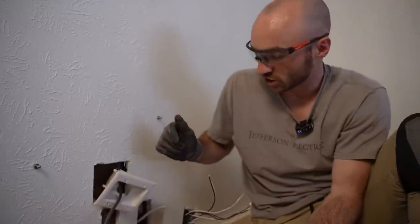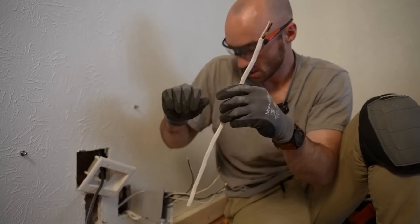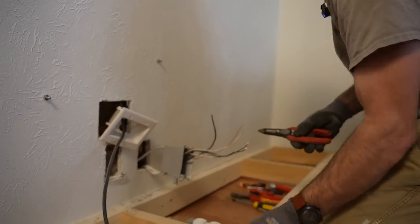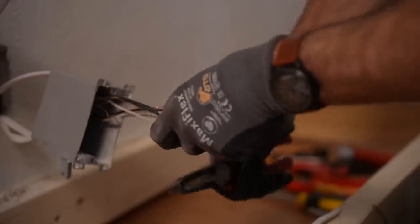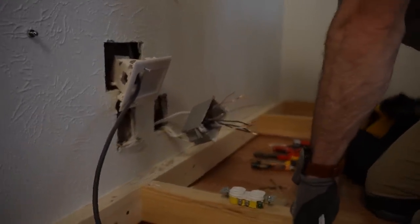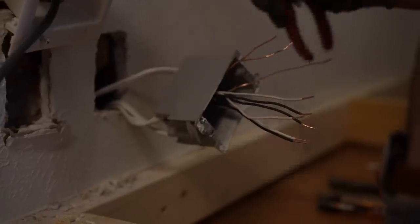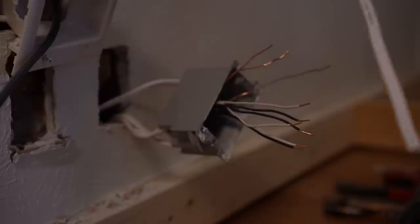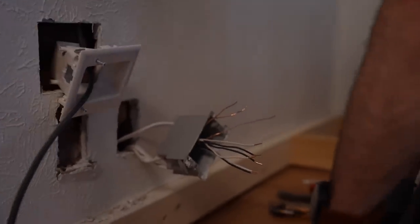This little length of wire that we just cut off from the TV load run, we're going to repurpose as pigtails along with some wire nuts. We're actually going to straighten out our shepherd's hooks because we're not going to tie them over the terminals. For box fill purposes, I'm going to trim them down. The cubic area of the box is determined by the NEC and the manufacturer to a specific number of wires. This is a Slater old work box that is a bit deeper than normal, so we are okay here. If you're using more than three Romex cables, you'll need to make sure you get a box with extra fill — often advertised that way, or just look at the actual cubic inch dimension internally.